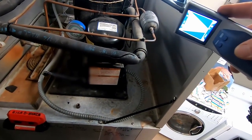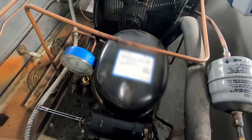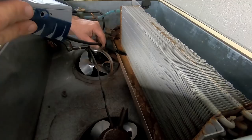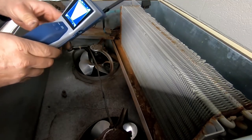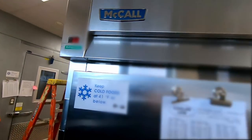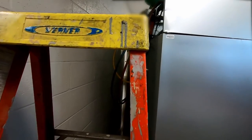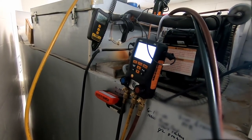We just scanned all this and didn't pick up anything. You need to scan the inside, which is usually where leaks are found. Here's a better look at what we're working on - six doors. This is definitely not a cheap unit - I think they got a quote for about eight thousand dollars. These are expensive for a quality one. It's at 66 degrees and starting to drop. It holds 20 ounces of refrigerant. A lot of times I'll pull the charge and weigh it in, but I'm going to just add a little bit and check subcooling, superheat, and all that.